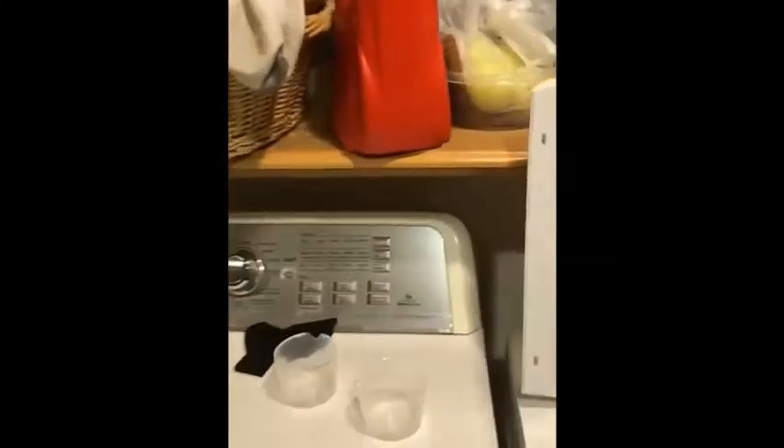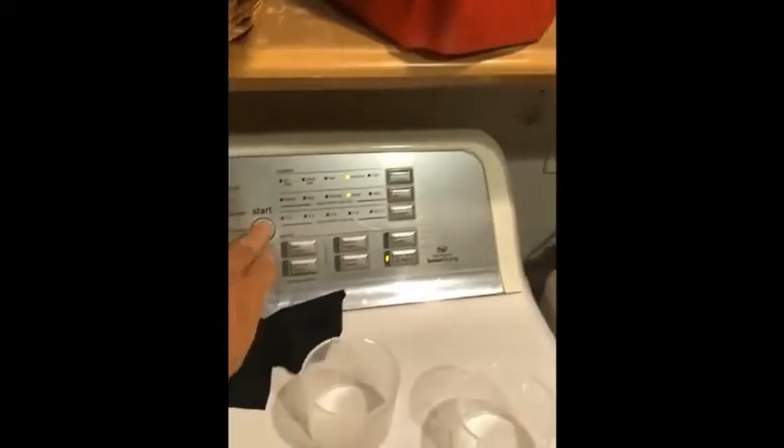The other things that cause low pressure in buildings — with the building buttoned up, all windows and doors closed — include the dryer. Dryers should be vented to the outside, whether electric or gas. As you turn on your dryer, you're exhausting air out of the house, and for every bit of air that goes out, an equal amount must come in.